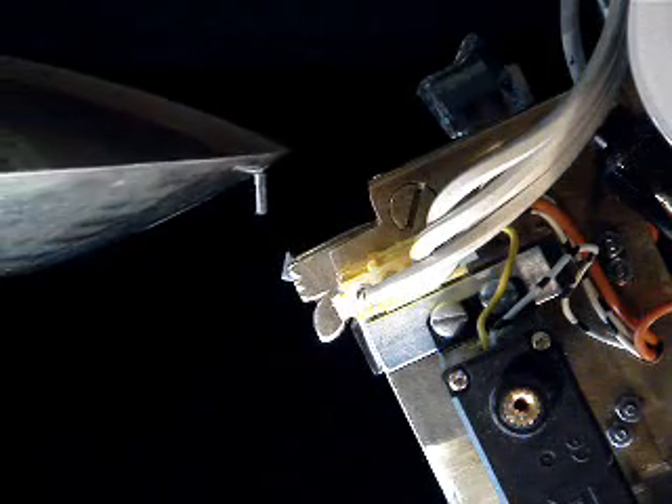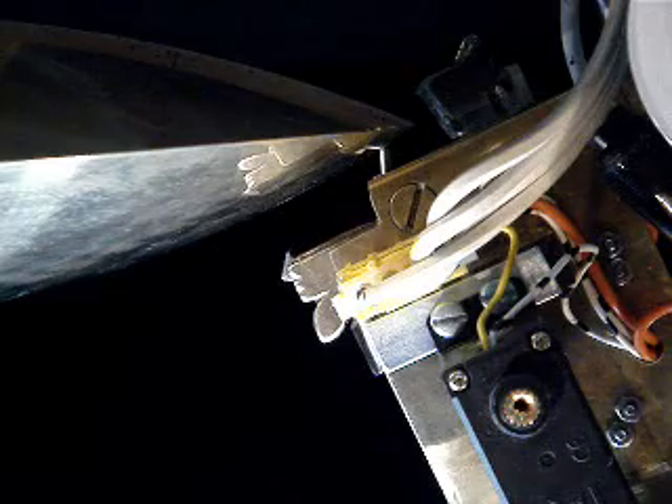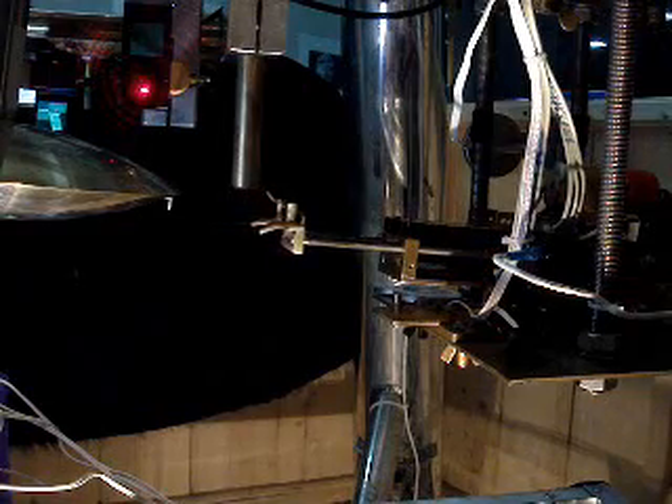This is the other edge of the bob, which has a pin on it. The pin is now coming up into the latch, being pushed by the pusher, which you can't see. It's now in position, ready for the latch to be cocked, which is going to happen in a moment. The latch now cocks. And now the pusher pulls back — ready to release. Now we see the pusher retract and pull back, leaving the bob hooked on the latch. When it's fully retracted, the pusher drops, and then we're ready to release the bob.